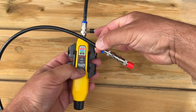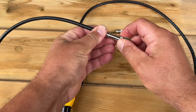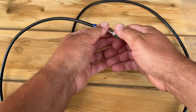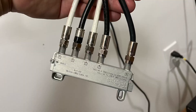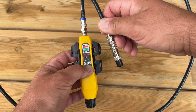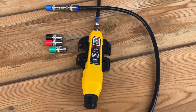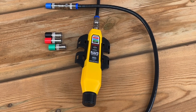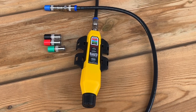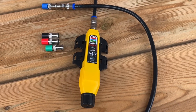The tester reads all of these individually, which makes it really handy. If you want to map out the cable run in your home, you can connect each of these remote leads to the end of the cable in each room — living room, bedroom, kitchen, wherever you have TVs — and then go down to the basement or wherever your splitter or amplifier is located. You can map out each individual cable so you know which cable run goes where, and also at the same time test it for shorts or open circuits. These remote test leads are really handy because in the real world you're not going to have both ends of a coax cable readily available for testing — one end is going to be in some room and the other end down in the basement. So this makes it easy to map out the cables in your home and verify they're all in working order.